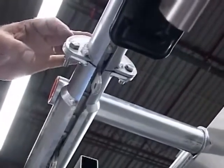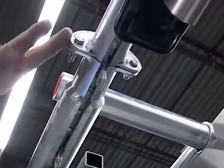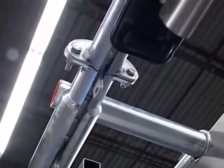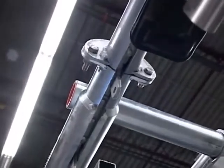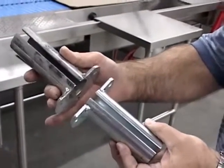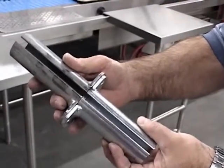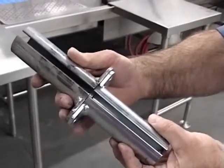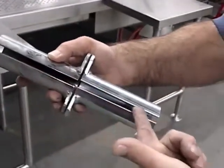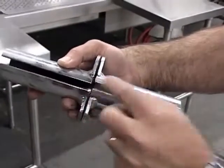The system is made up of tubes. The tubes vary in length from about 4 feet to 2 feet. There's approximately 20 flanges on the system that we'll have to go around and check each one and just make sure the nuts are tight. As mentioned, the tube is made up of a series of short and long tubes with flanges on them. When the flanges go together, it's critical that the groove is actually lined up perfectly, so as the chain is running through here, it doesn't jam up. If we're twisted a little bit, it's going to catch and jam up the system.